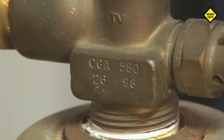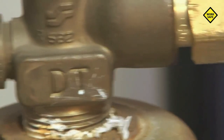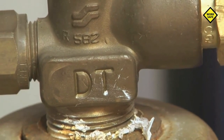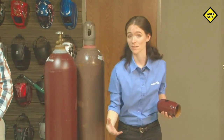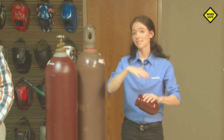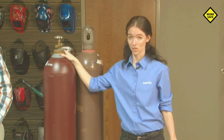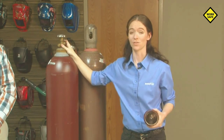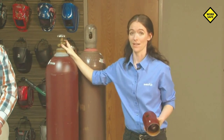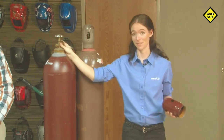It's also important, if you have a mixed gas, to inspect the side of the cylinder for a stamp that says DT. This stands for dip tube. A dip tube is a tube that goes all the way to the bottom of the cylinder and has a lot of holes in it. This ensures that should the gas settle out and the CO2 or oxygen become separated from the argon, you're getting the proper gas mixture. If a cylinder doesn't have a dip tube stamp, it would need to be rolled or burped prior to use to try to get the gas mixture more accurate. However, that's not a hundred percent, so always look for a dip tube stamp on any mixed gas cylinders.